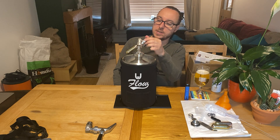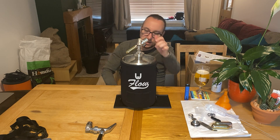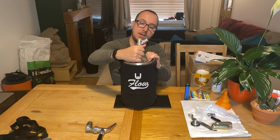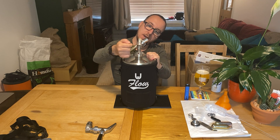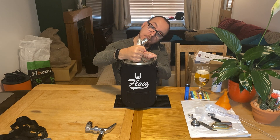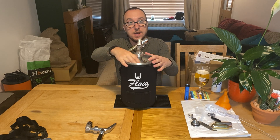I'm just going to increase the PSI to around 10. You just slowly turn until you hear the gas releasing. And then what you do is purge the oxygen that's at the top — just pull this quick release so it bumps down to about five. Just another little bump. So that's the oxygen out, which is good, and that's the first thing you'd want to do.